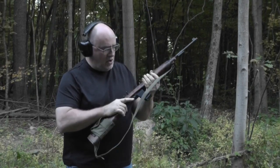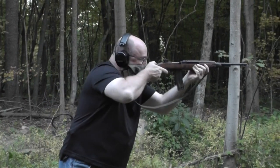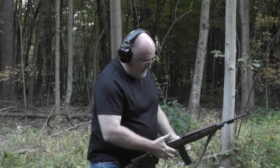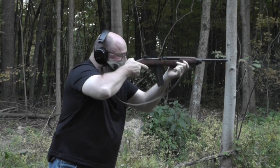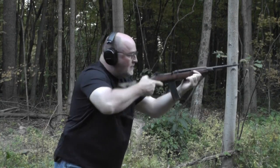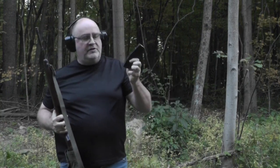I got a 30-round magazine — I don't know if this is a government one or not. Gun's still on full auto. Let's see if it'll work. No — the spring is just not heavy enough to keep up. For giggles, we're going to try semi. If I could find a new mag spring for this, it would probably work on select fire. Let's see how it works with less ammo to move. Worked better. That's the secret I guess — until I get new springs, only load these to about 22 to 24 rounds.